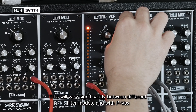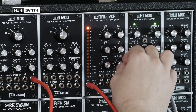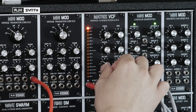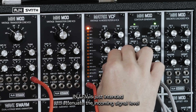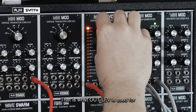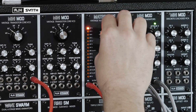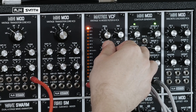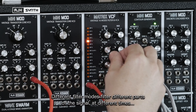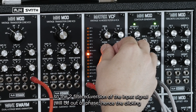This will vary significantly between the different filter types, and also with the Polyvox mode on. Input level is just intended to attenuate the incoming signal. Depending on what filter mode you're on, it won't necessarily stop all of the signal going through the filter — that's what the output control will be used for. The mode pot will change the filter mode, and you will sometimes notice a little bit of a click between different filter modes, because the different filtered versions of the incoming signal will sometimes be out of phase with each other. Hence the clicking.